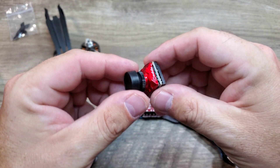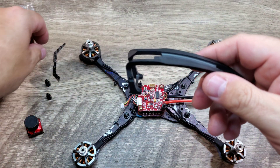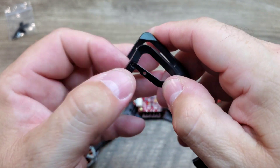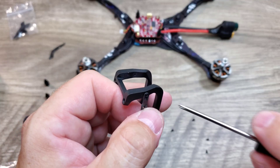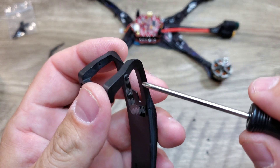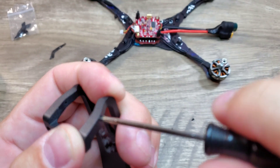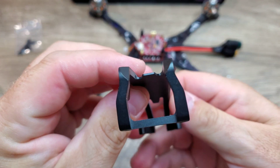Now that we have our camera wire all soldered up to the flight controller, we need to go ahead and install our camera. We're using the Caddx Ratel little micro camera. In the Diatone JC kit you get your top aluminum frame cover and these little carbon side plates that go across like so and get secured with two screws — this is the bracket to mount the FPV camera inside the frame. Keep in mind these screws are very tiny, so you're going to need a very small screwdriver. I started the screw inside the carbon plate and now I'm tightening it up in the actual frame, just snug — not all the way down, but just snug enough to keep it secure. Then we'll do the other side.